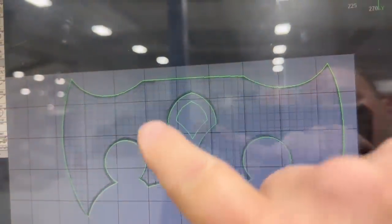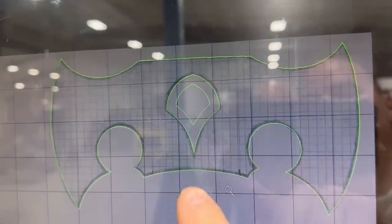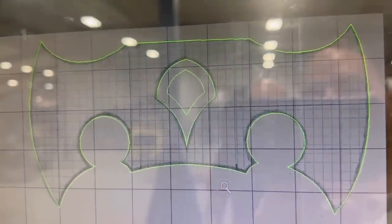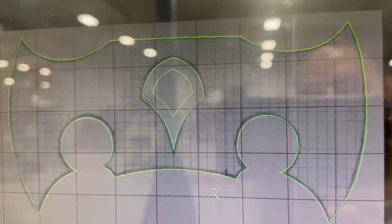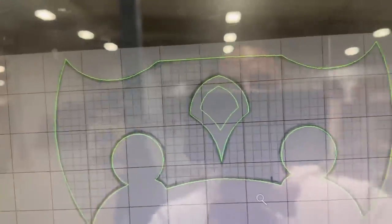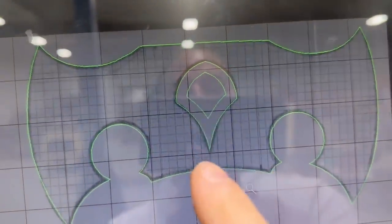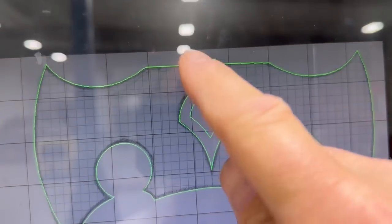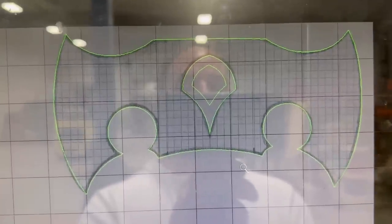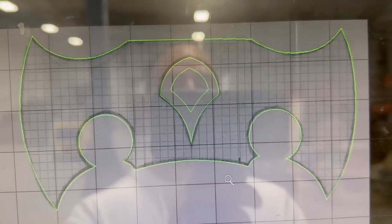And one thing that we did in this center area is I shrunk down the center hole that's going to be in there, because it left a very small web of steel here and up here that would, I guess, maybe compromise the integrity of that steel when I put the handle back in it, that it might actually split that or that. So that's why I shrunk that down, to give it a little more steel on each side of the top and bottom points of that. But very quick process. That literally only took him about 2 minutes to program that in and create a cutting path.